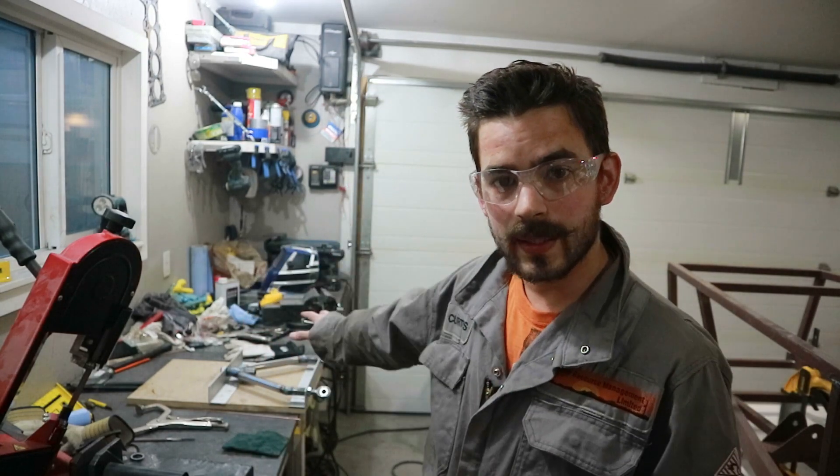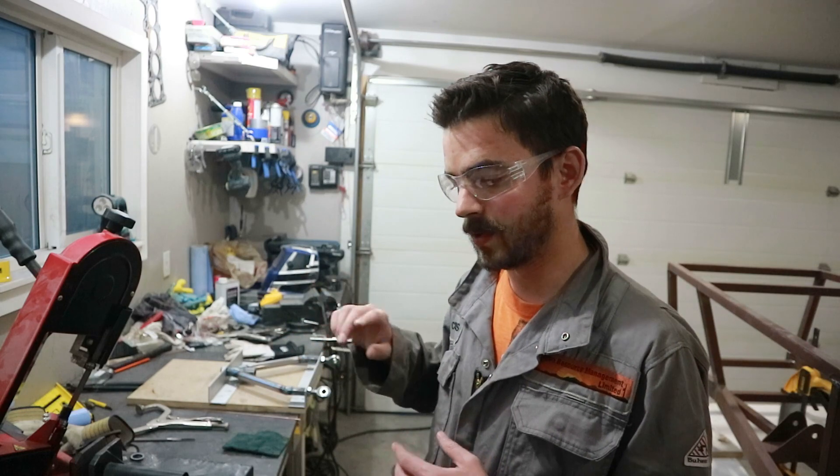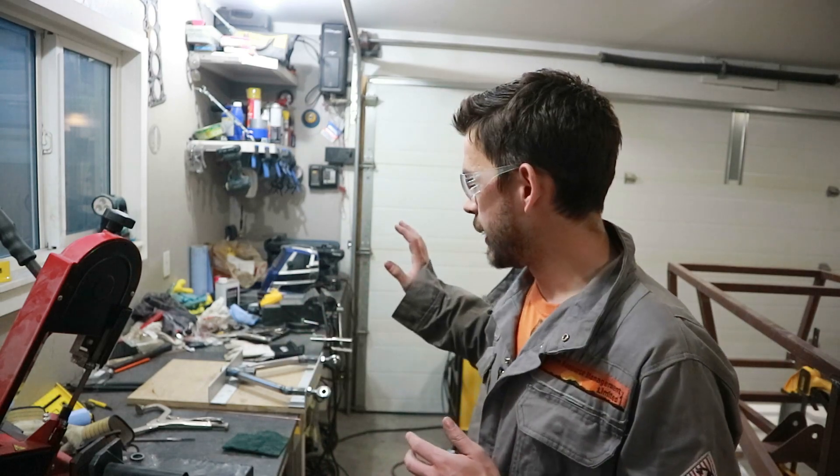That's all welded up. One of the flaws of that jig is that I can't weld the back side of it, so I had to flip it over and weld it - it's a little risky if it starts to warp, but I think we kept warpage to a minimum. We'll go in later and add a cross brace in between the two heim joints to make sure they don't spread apart. That's it for this episode - thank you so much for watching. If you haven't already, hit the like and subscribe button, check us out on Instagram at leftfootfirstmedia, and we'll see you next episode.